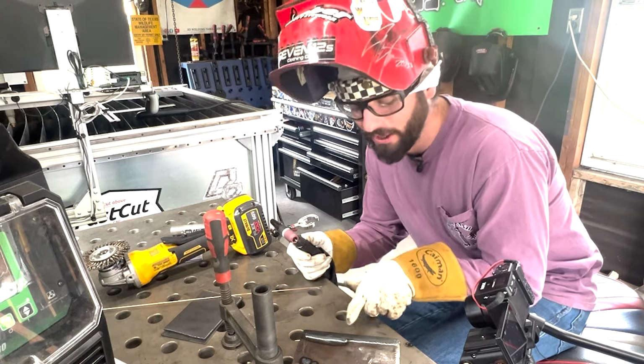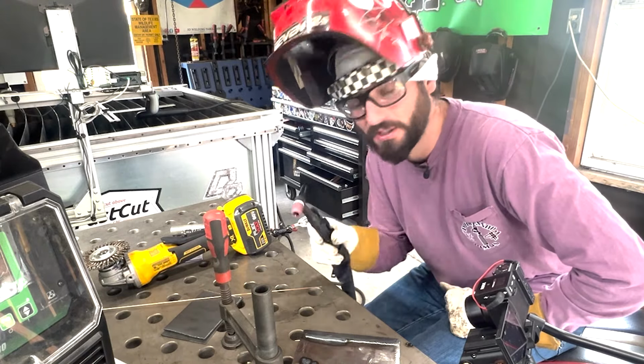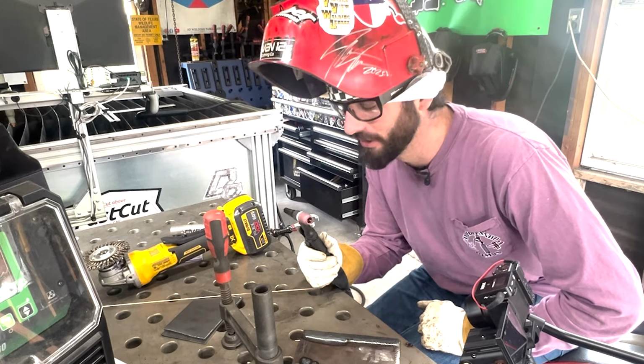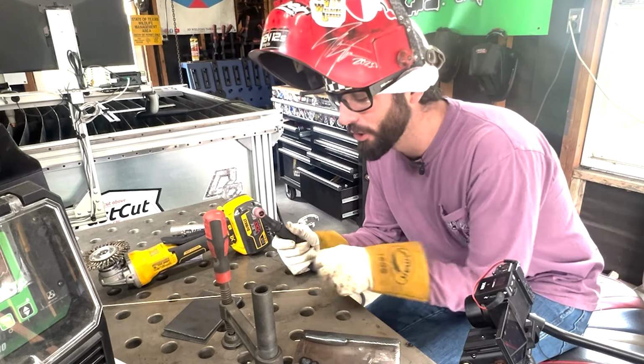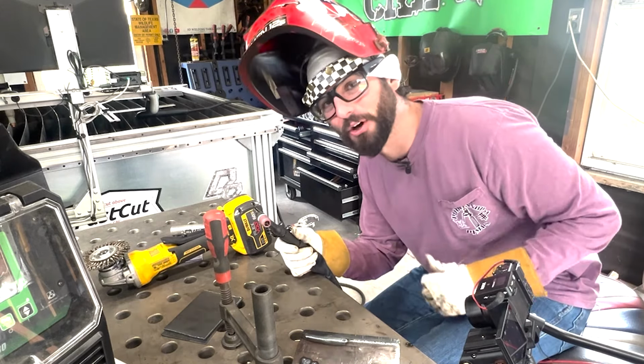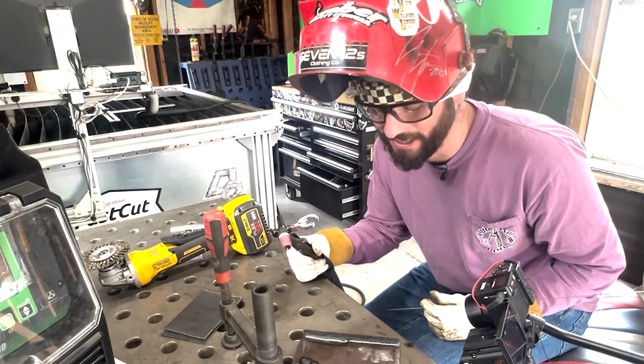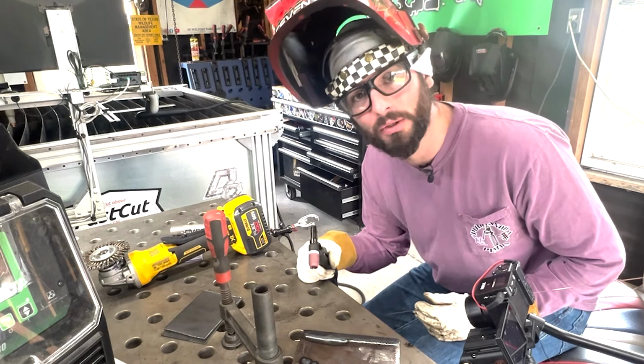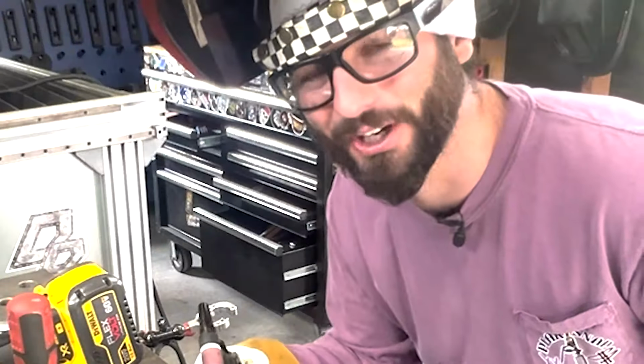One thing to note, if we're welding any type of groove that is going to be X-rayed and we've left a nice hunk of tungsten in that puddle, what's going to end up happening is it's going to show up as a bright white shiny spot for all those inspectors to see exactly how bad we made a mistake. We don't want that, so if you do know you've snapped off some tungsten, be sure to grind it out.